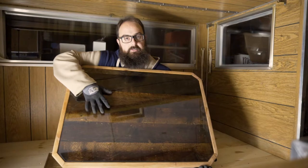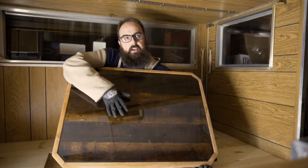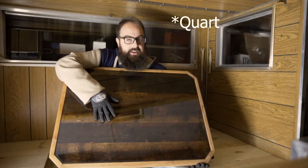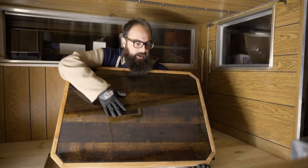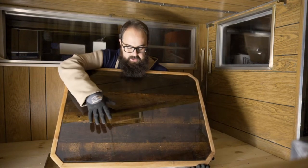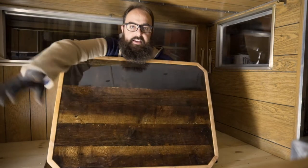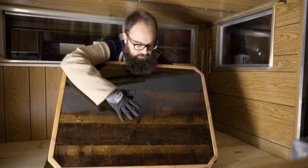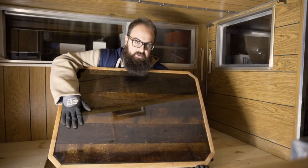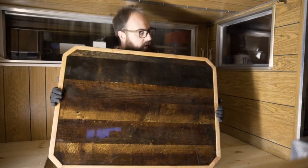On top we used Glaze Coat epoxy — I'll link it in the description, it's really good stuff. You have to make sure you seal the wood first if it's really porous, like this. They say use a quarter of the mix as a seal coat first. I got a pint which covers about nine square feet. This actually took two coats because I didn't do the first seal coat — we got a lot of holes that dipped down and created a lot of bubbles. So we had to sand it down and reapply. Sanded with 80 grit, then 150, 220, 400, and 600, then poured it back on and it turned out pretty well.